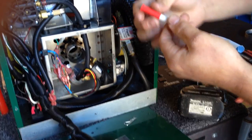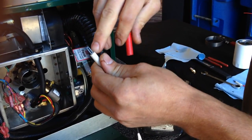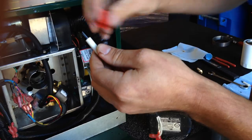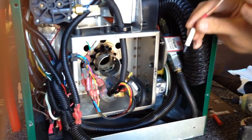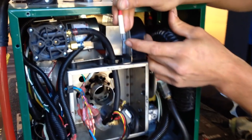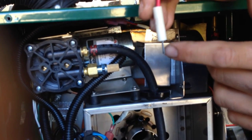When pulling the protective tip off the igniter, you want to pull it straight off. If you bend it, you're going to break that tip and it's not going to work. When we put it back in the igniter holder, it's important that we see the horseshoe shape when we put it in there. You don't want to put it in on edge or your heater is going to have a hard time lighting off.